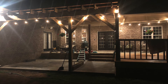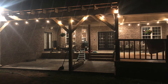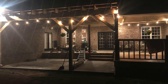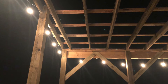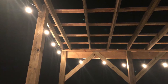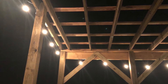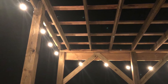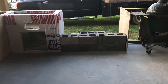We use six-by-sixes in our framing — just a traditional what we call pole barn framing on our bands and plates. You can see here some of the six-by-sixes, the way we notch it to set our plates in there and tie everything together on our outside rafters, and some of our lath that we ran to put our tin down. Pretty simple framing, nothing really complex about this.